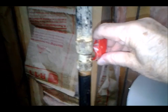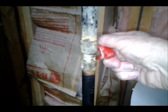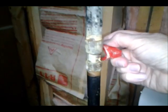First thing we want to do before we do anything at all, other than shut it off, is to turn the gas valve off. And here's my gas line coming in. It's copper here, but here it's more conventional cast iron pipe, and this handle is running parallel to the pipe, so that means it's open. So to close it, you have to turn it perpendicular, and in this case you turn it clockwise, and now the gas should be off. So now we're ready to disconnect the pilot.